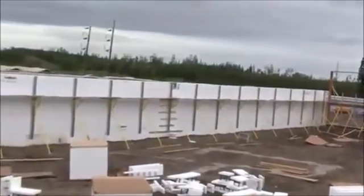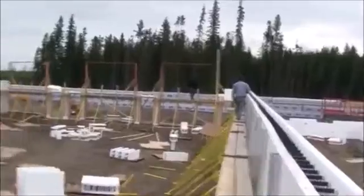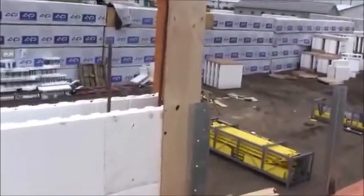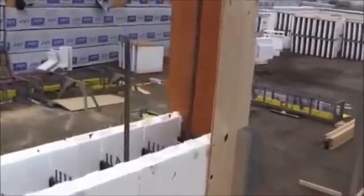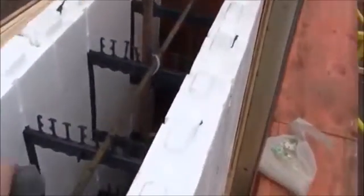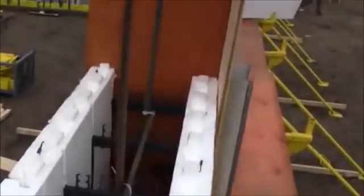All the scaffold is completed and the block is up to the top of the scaffold, which means we're finished with the block. Now if I look over here, we put a couple of vertical bars in. They're going to stick out 2 foot above where we're going to place concrete. We're going to place concrete about halfway up that tie, and then carry on with the build to the top — 2 foot above these openings.